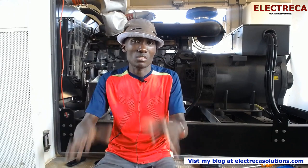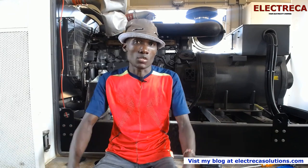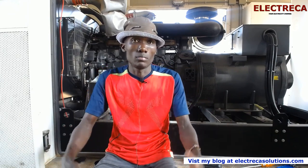Then there is some kind of setting you can do, what they call fuel delay pressure. So you can set that. Sometimes it happens that there can be a delay, maybe there is a small gap, but it catches up. But if you fill them to the maximum, sometimes those kinds of problems don't arise. So you saw the water separator as we filled it and put it there. Then we changed the air filter.